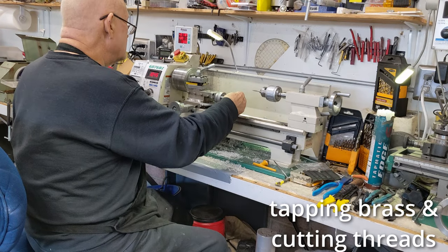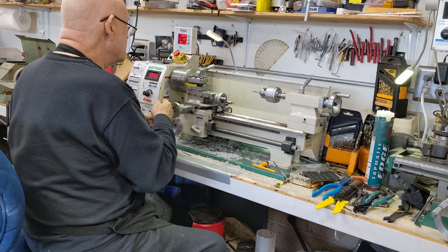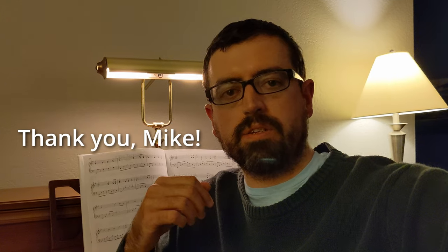And cored out the back using a smaller drill that was deep enough to match what was in the original knobs. Lathed down a brass rod to fit inside there, which we ended up using for the threads as well. I had a set of some kind of jewelry making screw and thread combo that I was going to use, but it would have been a little looser. And since Mike, the guy, had the capability to make something on his lathe, we just went for it, and it fit very snug.